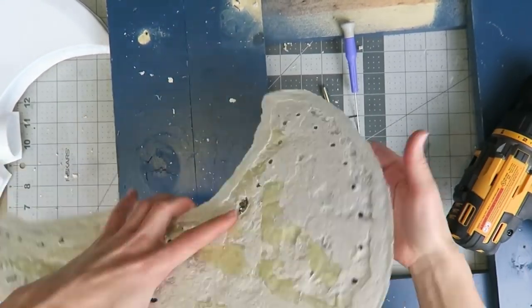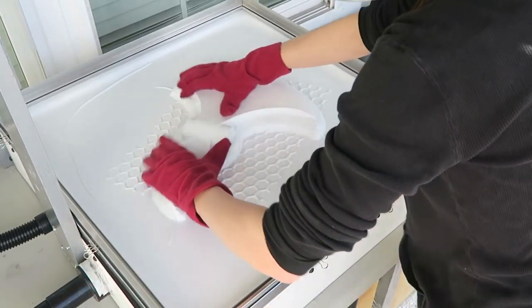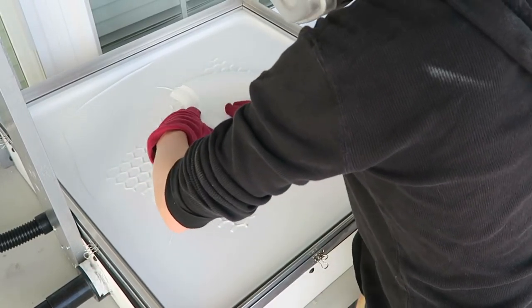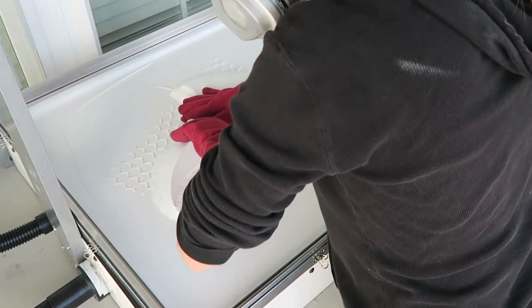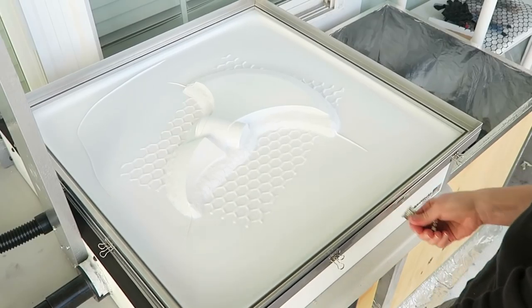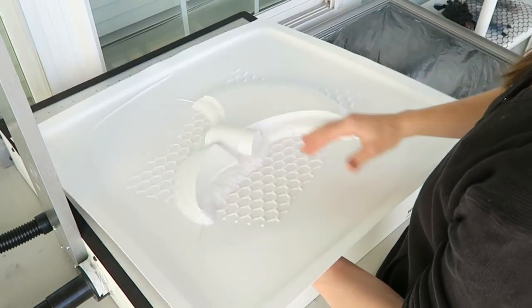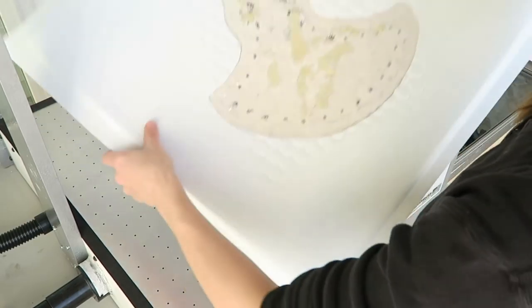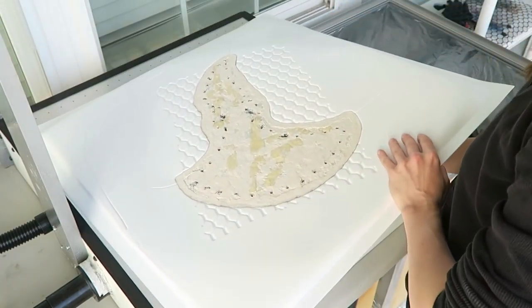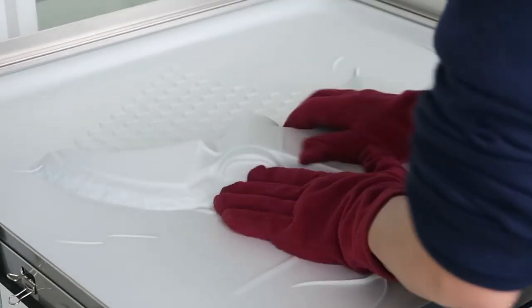In addition to the new bases for the molds, I also added sturdy guides to the vacuum former so I can lower the frame faster and more accurately, and I got a little more suction by removing an old clogged filter that was giving one of my vacuums a weaker pull. A vacuum pump and tank would be a good future upgrade, but for now I'm working with what I've got. I also heated the styrene up to 350 Fahrenheit this time and the details are coming through better with a more defined cut line.